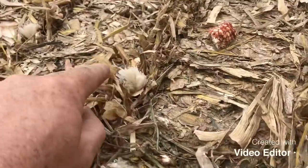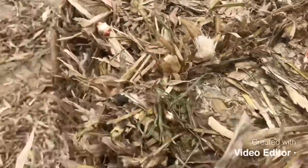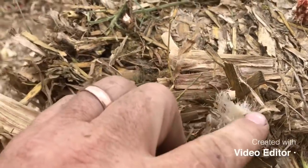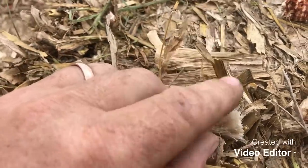If it starts fraying or cutting erratic, that's a problem with your twine discs and your knife on your knife arm or your wiper arm. If that is not right and it starts getting frays, you need to change your knife, the knife on the knife arm.